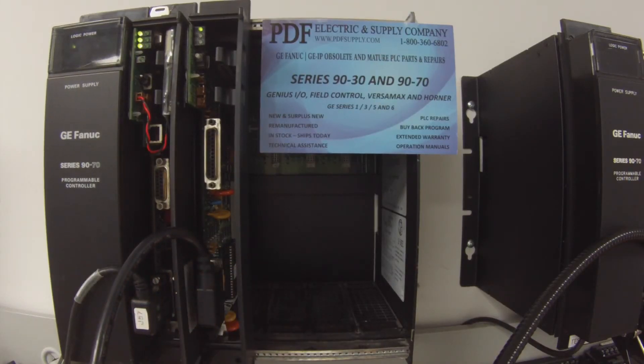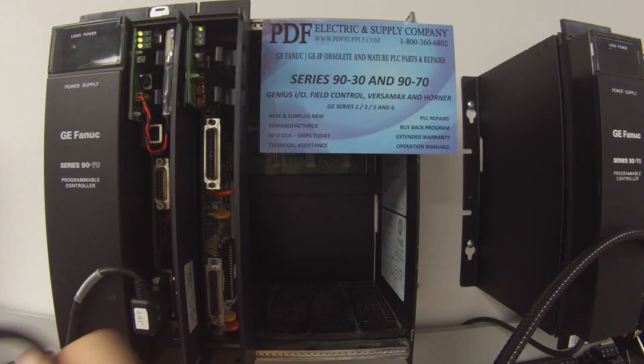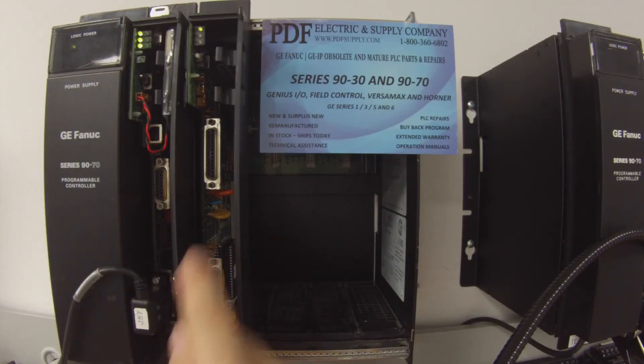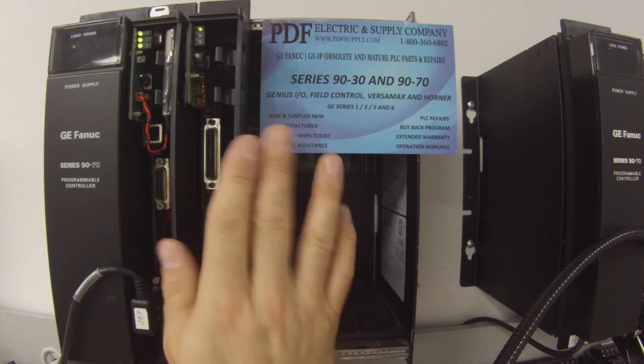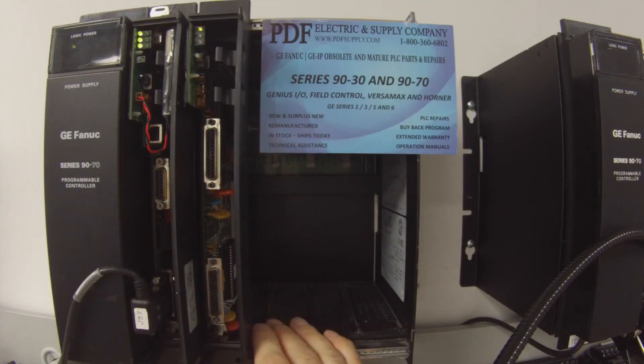And port number 2 — Try All — I have an immediate reply. That's working fine. That completes the test. If you have any failures with port 1 or 2 when using the RS-485 interface, there's a problem with the coprocessor, and it's something that we do repair here.